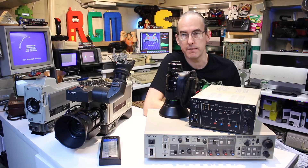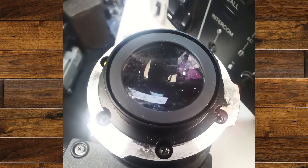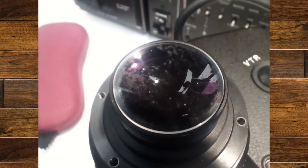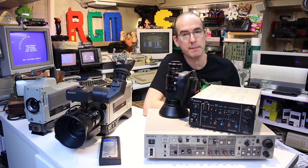Now you can remove the infrared filter, but unfortunately the camera won't focus properly without it, so you do need to use it. I thought I might get away with not using it because I'd only planned on using the camera indoors, but obviously it's not going to work - it needs those segments to work out the focal length. And as you can see, the lens has suffered with mould as well, which has made it quite cloudy, meaning I only have one lens between two cameras. After removing the infrared filter and having a closer inspection, I noticed there were three parts to it - two outer glasses, one slightly thicker than the other, and then the inner glass.